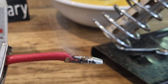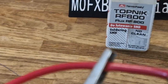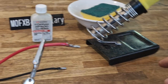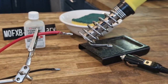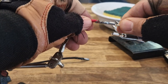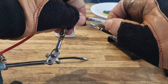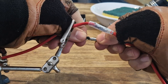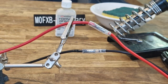I think that's got it. Let me just wipe off on the sponge. Turn the iron off as soon as you can - that's what I do. Don't want any accidents. It should cool down, and then we'll get our red and black covers on and slide them over. Feels solid. Get the red on there - you can squeeze those things. Slide that over. Get the black. And of course I can just wrap some insulation tape round as well, just to be sure. But I bet if I just heat it, it will shrink anyway.